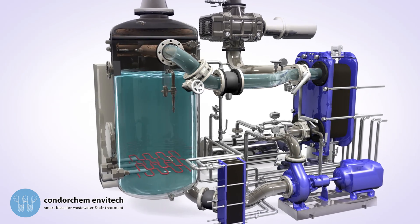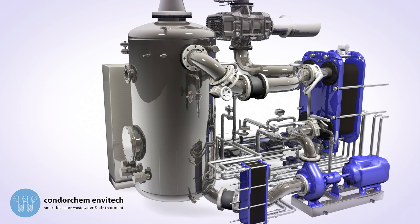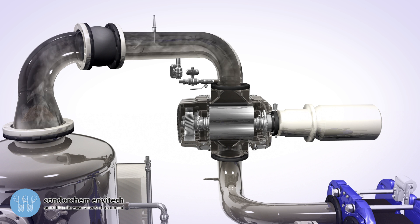At this point, the resistors stop, and the vacuum system reaches a value of 240 millibar in the evaporation boiler. From that moment, the wastewater begins to evaporate, and the roots pump starts working, inhaling the vapor from the evaporation boiler.